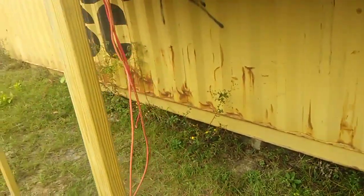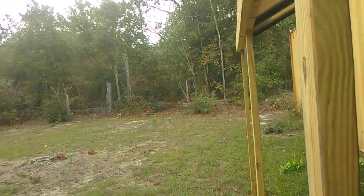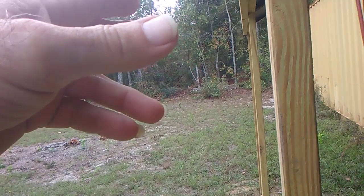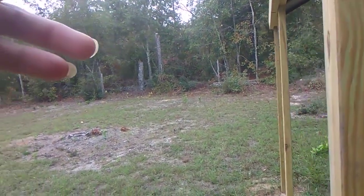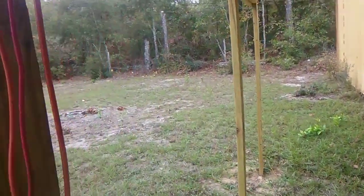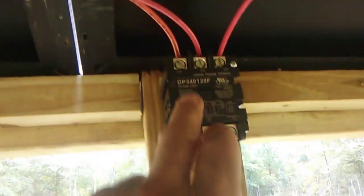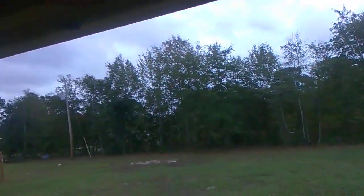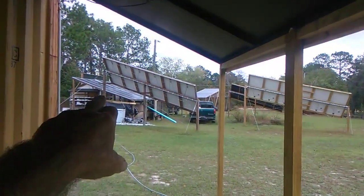What I decided to do was, since these nine panels aren't necessarily needed in most situations and on most days, these panels will only be activated during low solar conditions. So what I did is I put up a contactor here. This contactor will be connected to those solar panels and I'll have a signal relay coming from the shed measuring the solar intensity. When it gets down low enough, it'll kick in this contactor and feed those solar panels into my existing solar panel wires.